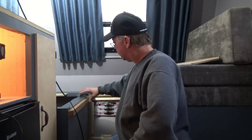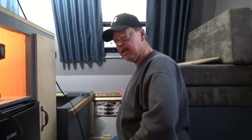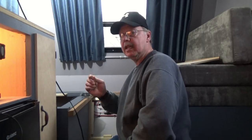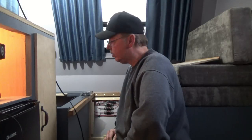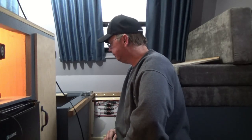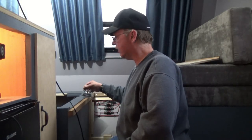I have my ground wire which I'm going to run first - I'm going to run it to the ground wire on the switch. Then I will take the hot wire and also run it to the switch, turn off my power, and make sure everything's connected. Then we will run a ground wire to the pump and from the pump hot wire we'll run a hot wire up to the switch, and with any luck everything works out fine. So I'm going to go ahead and start running wire.